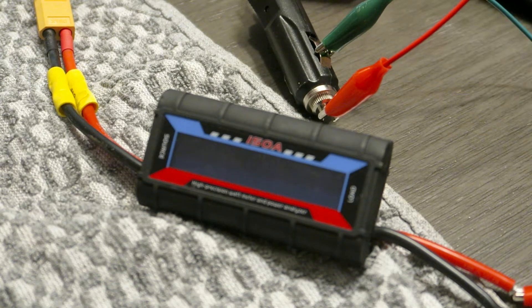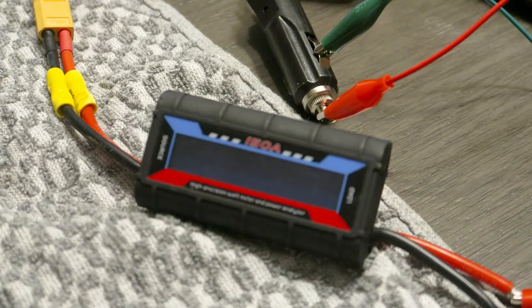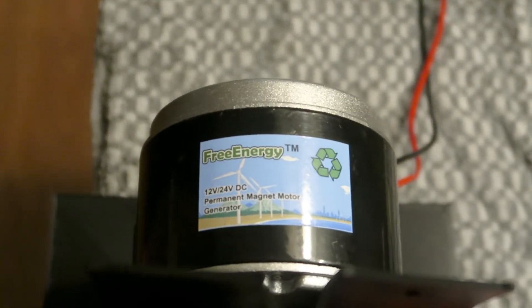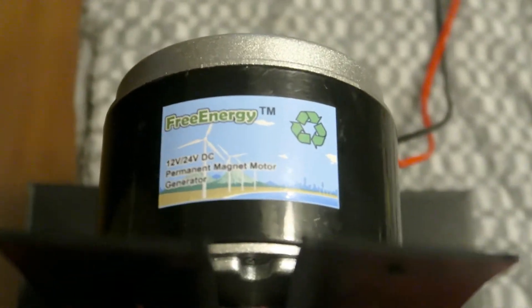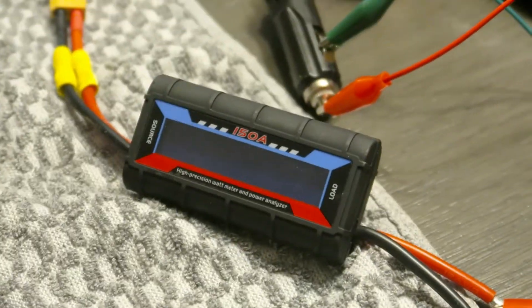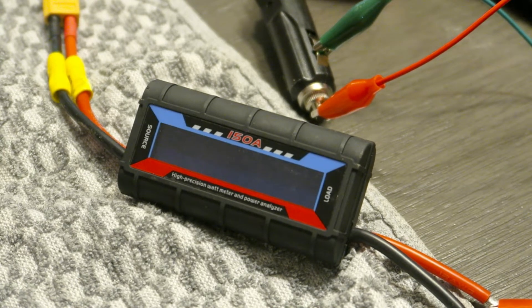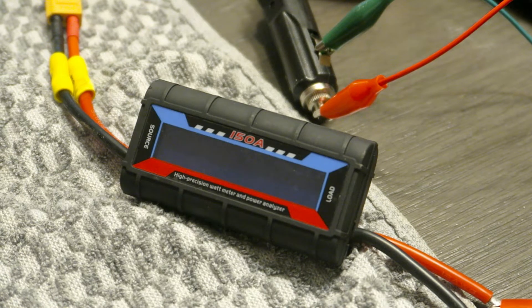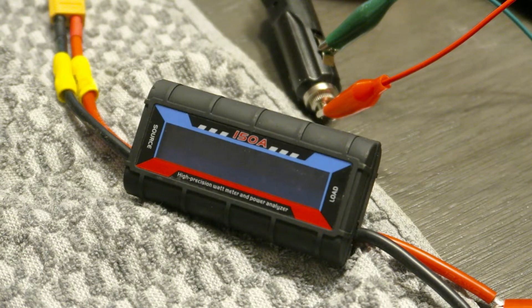It has slowed down a little bit already. So if it doesn't slow down further, it seems like this could be up to 150 watts — it doesn't say it on here, but when I bought it, it was advertised as a 350-watt motor. A lot of other identical motors are advertised as 250 watts. We've already produced 4.5 watts, so anything above that I'll be pretty impressed. At the end of this project, with a charge controller, as long as you get enough resistance on it, that's the wattage. It's interesting to see it can already power the fan, so let's see if we can do the heater.